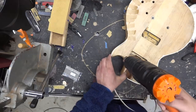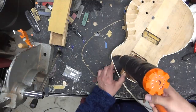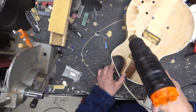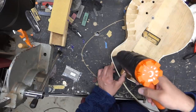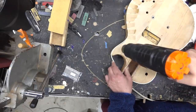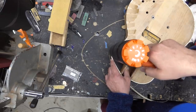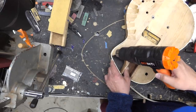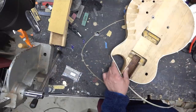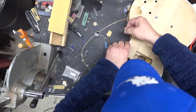I'm just going to heat this up and slowly bend it — I've got it on low heat. This is a heat gun from Amazon. We're just going to heat up that corner and slowly bend it over. You can see I make some adjustments to make it just slightly hotter. What I didn't want to do is get it so hot that it bubbles, but just hot enough to bend along that curve. You want to heat up the top and the sides and the bottom, moving the heat gun all over the place, and as soon as it gets hot enough we'll make that bend.